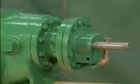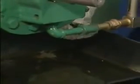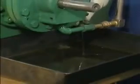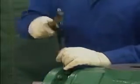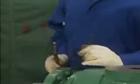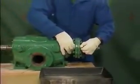This is done to expose the bearings in the inboard bearing bracket for inspection. The end bell contains a reservoir of oil that's used to lubricate the bearings, so he'll have to drain the oil first. To do this, he sets a pan directly under the end bell and then removes the drain plug. While the oil is draining, the mechanic can place witness marks on the end bell and the bearing bracket, as well as loosen and remove the end bell's nuts and bolts.